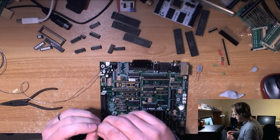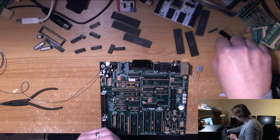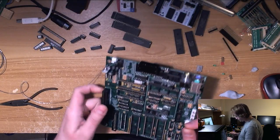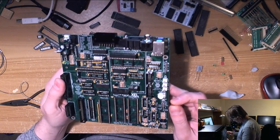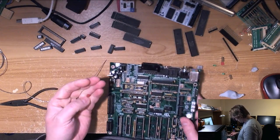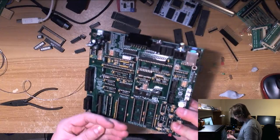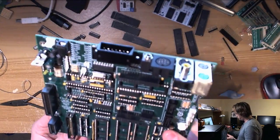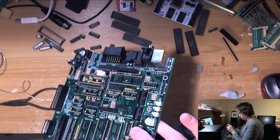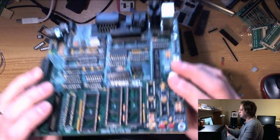Make sure that the jumper labeled OSC is closed. It was a mistake I had and had no system clock. Okay, let's stick some jumpers on before we do anything else, because I will forget that. So OSC, just jumper that one. And the other, obviously, is NTSC PAL. I think Michael mentioned it earlier on. It's got a common center pin. So we're going to go for PAL, of course. So the jumper's going to go on there. Does that look correct?